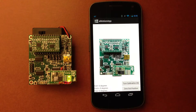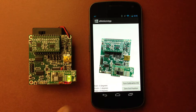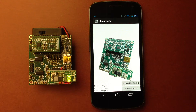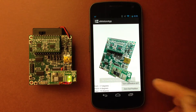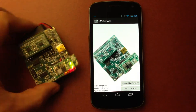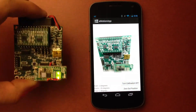We also have the gyroscope. As you can see, the gyroscope has a little bit of a drift. On this one we can see the yaw, pitch and roll changing while the gyro is at rest. We can click on calibration here and do a quick calibration. The calibration is going to last about three seconds and it should be good enough for that demonstration. So now it's not drifting anymore and we can actually move the sensor on the yaw, pitch and roll.